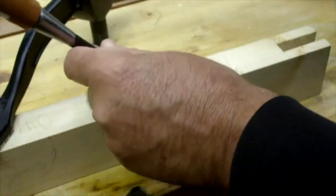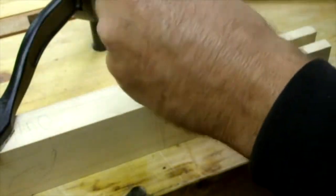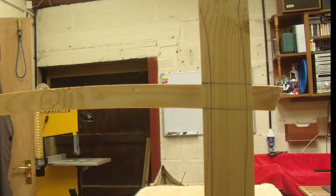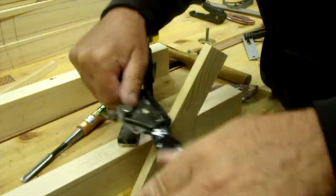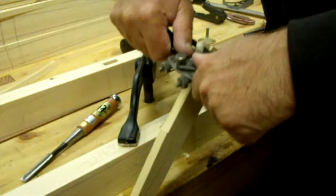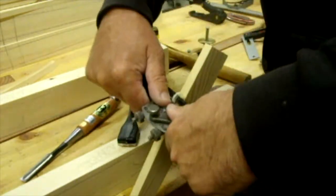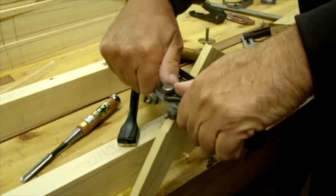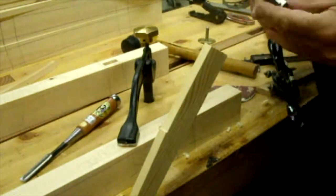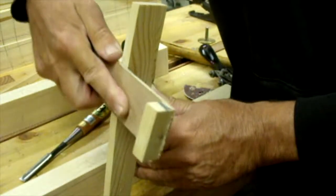You can see from the side shots here, I've actually drawn the path of the way that I want the mortises to go, so I've got to line up my chisel with those lines and tap away. For the lower rails, they just need a little bit of fettling, so I'm using the spokeshave. I'm giving it a measure and checking it's square. A bit of sanding to get right into the corners just to finish them off.